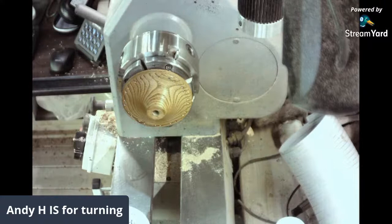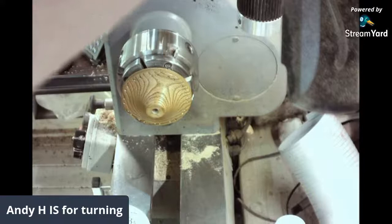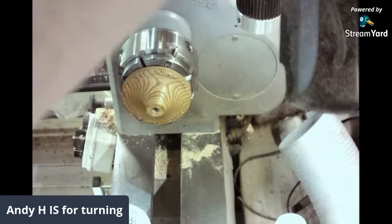What about the microfine abrasive paste? Would that be more gentle, wouldn't it? I think I would just burnish in wax if it was me, if it's not lifted the grain. I've got microcrystalline wax. Start off with something like wood wax 22, and then you can always go over it with microcrystalline. I haven't got wood wax 22. I've got speedy friction polish from Yandles.